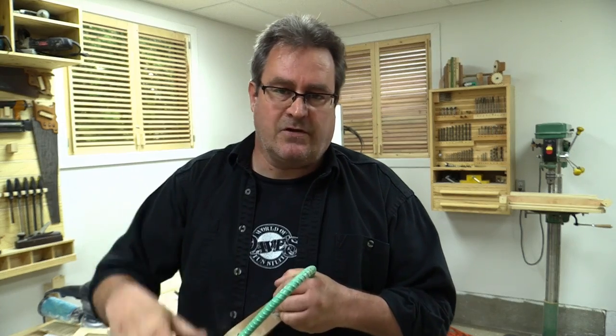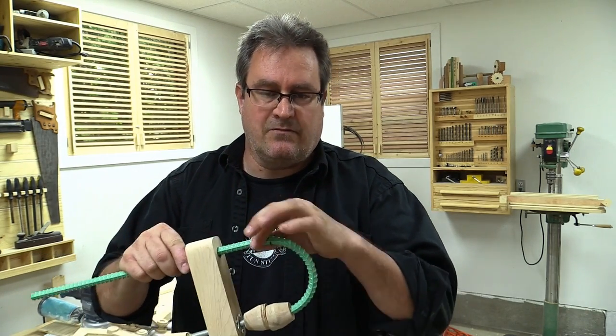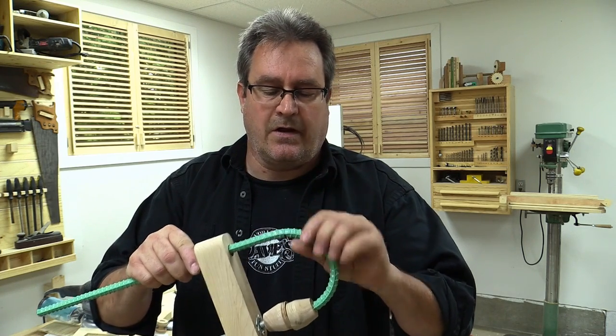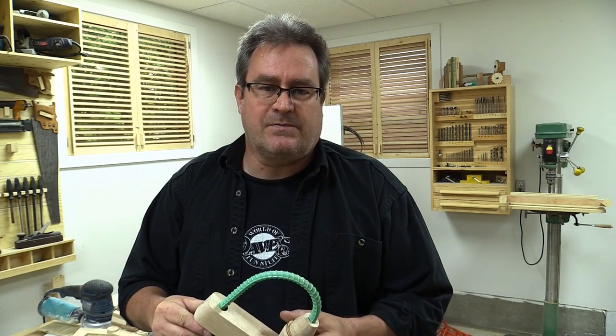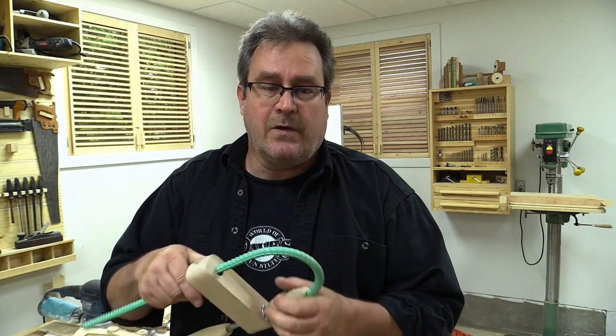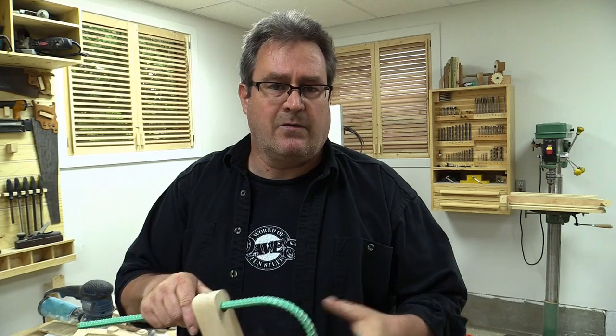The salt will penetrate the concrete and rust the rebar, and that's the reason why you see this green epoxy coating. The epoxy coating is pretty much inert after it sets up, and there is virtually no way to breathe it in unless you're cutting it with a grinder. And then the particles are going to be too big to really do you any damage anyway.